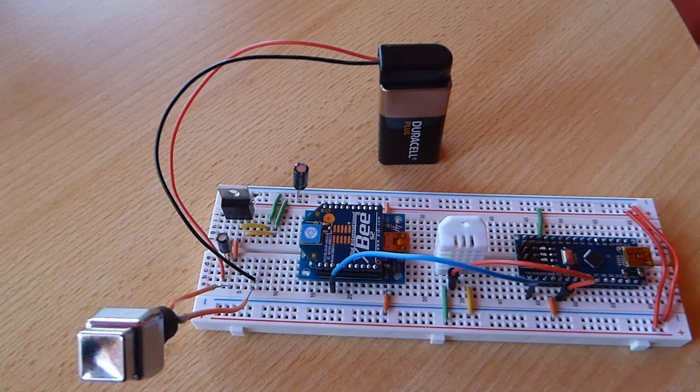To the left of the breadboard is a simple on-off switch. This is attached to the ground terminal. This is followed by a voltage regulator circuit which includes two electrolytic capacitors. You can buy these circuits already built, and I'll show you 3 examples later on. The voltage regulator circuit reduces the voltage down from 9 volts to 5 volts.